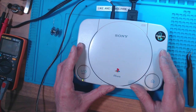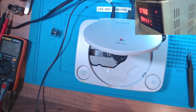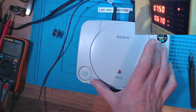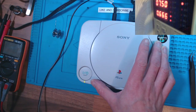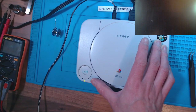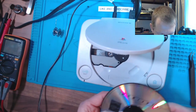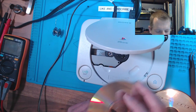It's gone again and it's resetting the console. I have a picture on the screen. I'll put a game in - it's cutting off, it's trying to load a game but the bench power supply is finding a short I think. It's resetting the console. I've only got one amp on the power supply - is it possible that one amp is not enough? I'll turn my amps up on the power supply.